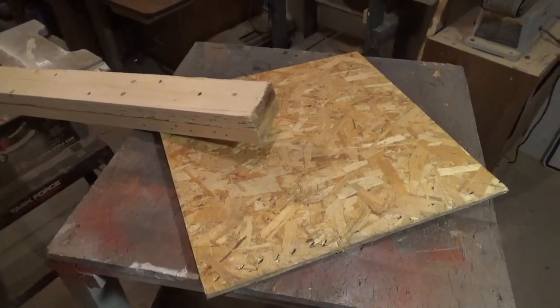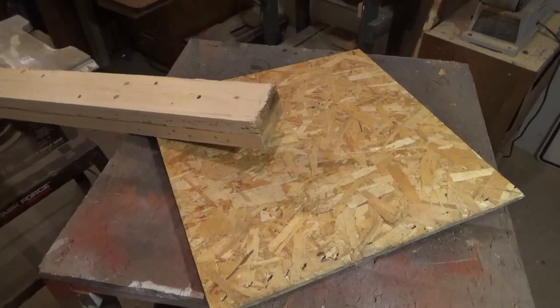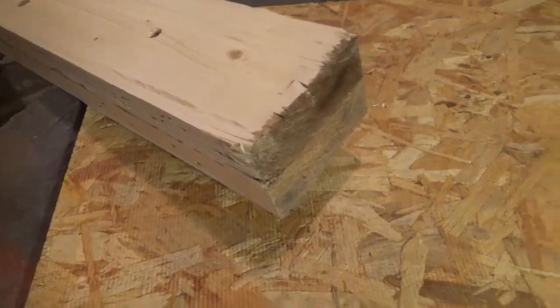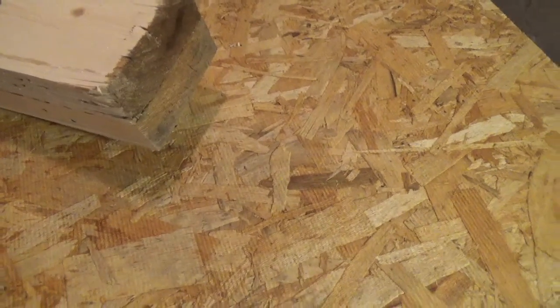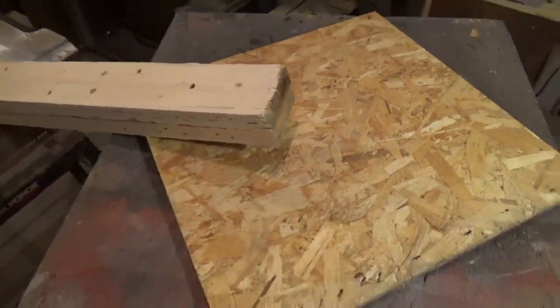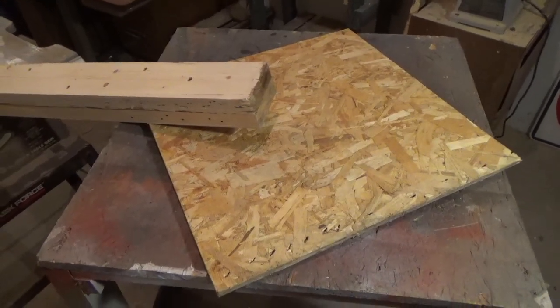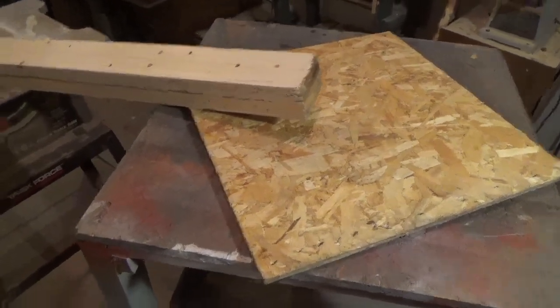There you can see our 1.5 by 1.5 piece of plywood, and I'm going to have to center up that main beam there and cut a hole right in the middle of it so that it passes through nice and easily. So let's get that done. I found the center of this board the easy way, drawing a line from each opposite corner, creating an X that found the center, and I roughly eyeballed where that center post is going to be seated. So let's go ahead and get that hole cut out.